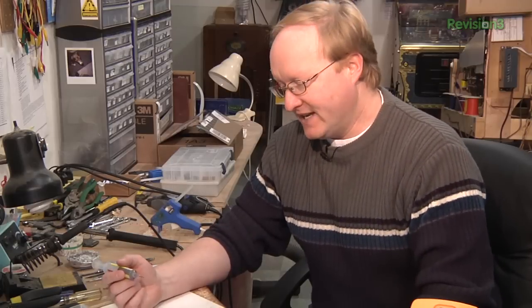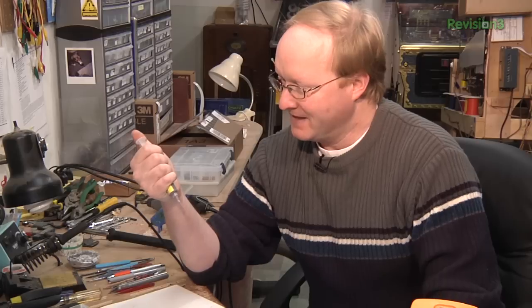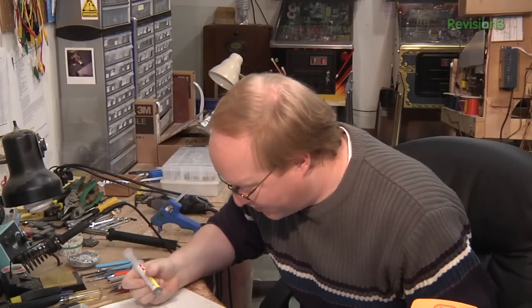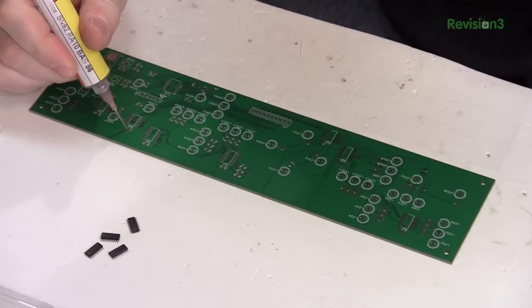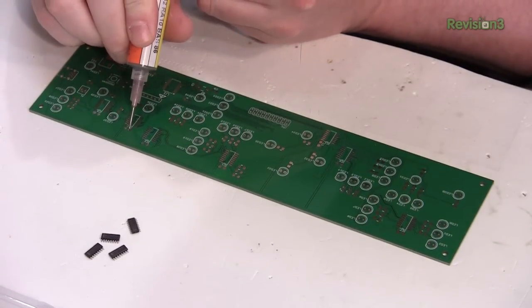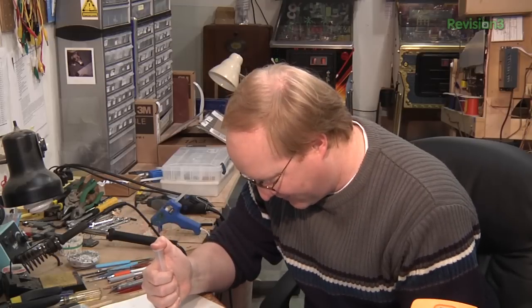The other way — and the way I'm going to do it today — is to just take your paste, I got this from Element 14, and with a nice needle and syringe, basically drop by drop, put it onto the board. I'm doing it this way because if you homebrewed an oven, this should also be a homebrew method. And using a laser cutter to make a stencil is not homebrew.